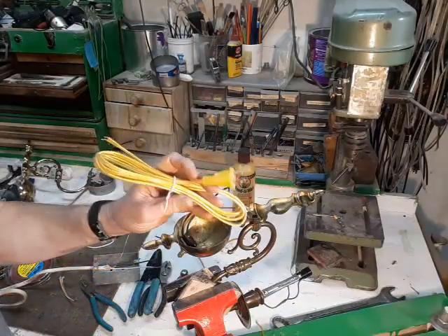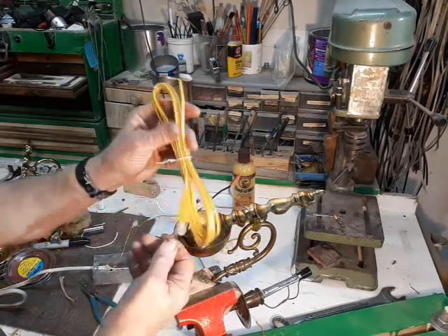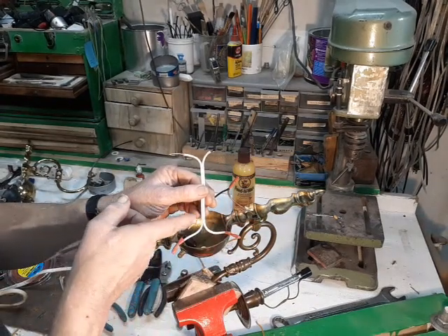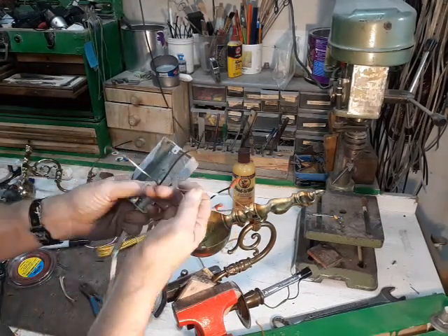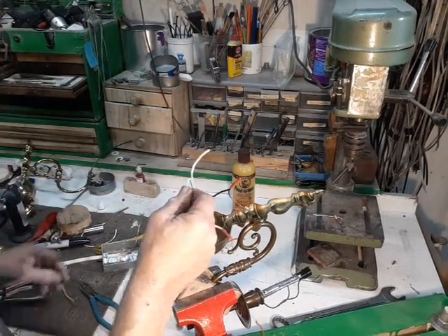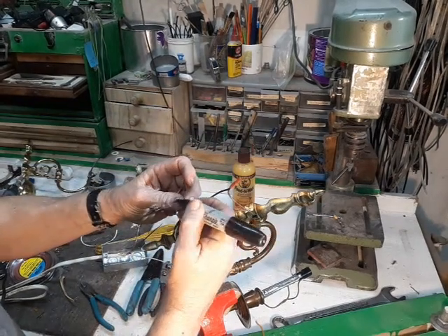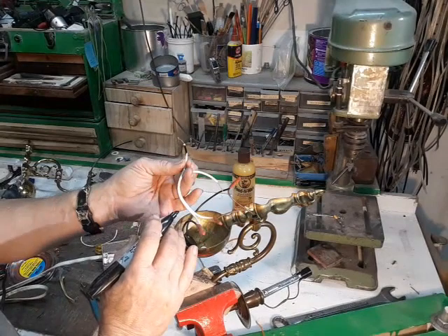Most sconce rewires I do, I install a regular lamp cord so the people who take it home can hang it on the wall above any electrical outlet and drop the cord down and plug it in. In this case it's going to be installed by an electrician who will have service boxes high up on the wall where the sconce will go. For that reason I've added a white pigtail, because the electrician is going to see a service box with a white wire and a black wire. The white wire corresponds to the side with the ridges, and the black wire corresponds to the smooth wire. So I color that smooth wire black, and everything will get wired up nice and correct — because there's no point keeping track of which wire goes where if the electrician is going to wire it up backwards anyway.